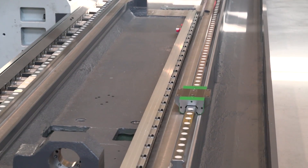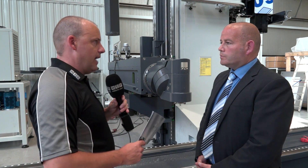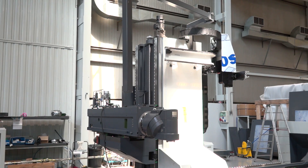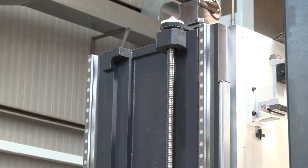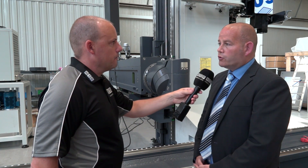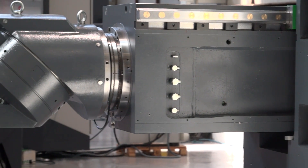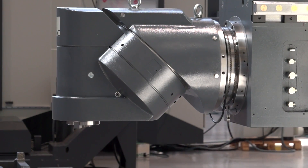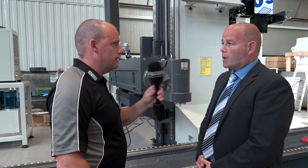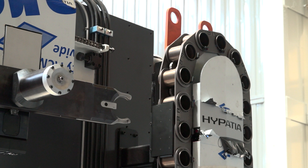The X axis is actually the same size as the Xperta and uses the same casting. The Y axis goes up to 1.25 metres and the Z axis goes up to 1.5 metres. The column on this Norma is much bigger than the Xperta — the actual column itself is the largest in its competition. In the UK market, this probably is the middle ground machine that people go to out of the three. The spindle is 50 taper, 6000 RPM, with up to 990 Nm torque. Tool changer goes up to 60 tools — it's modular, starting at 30, then 40 or 60.